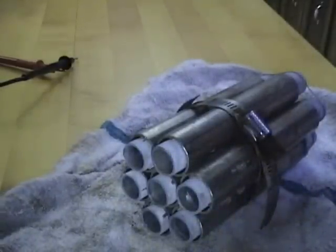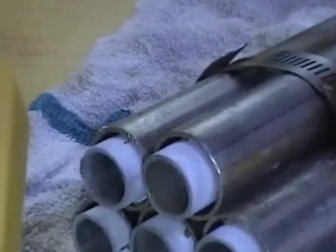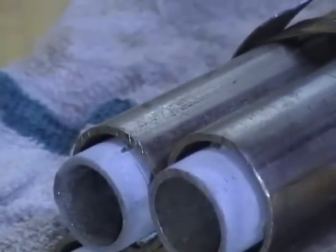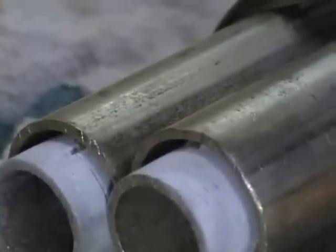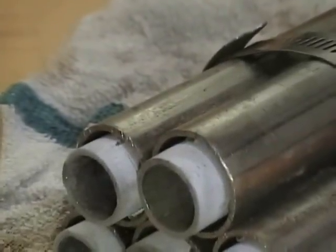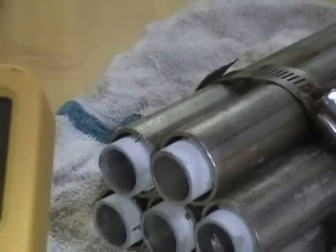Let's look at what the conductivity is, and let me get a zoom in of the powder. A little bit is on the inside of the cathode, but most is on the outside, and also a good amount gets on a ridge. You can see that coating is definitely there. It's easier to see when you take them out and let them dry compared to if they're still sitting in water. You may have quite a bit of that coating and not realize it if your tubes are always wet, so let them dry out and take a look.